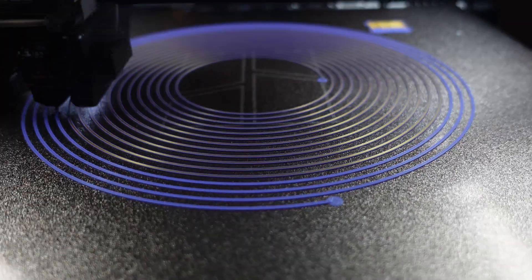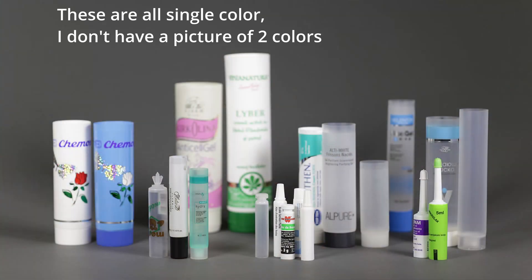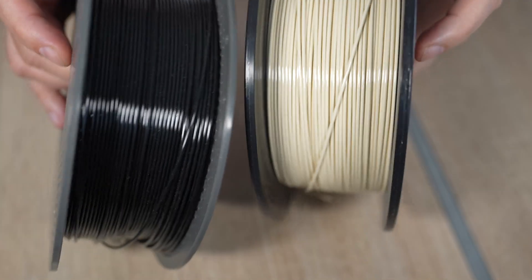This file used in this video I will upload to Printables, along with the source Fusion files if somebody wants to modify it. Maybe the layer adhesion difference between tough and silk PLA was too extreme, but even this confirmed the core filament layer adhesion theory. Now manufacturers have this tool to test their formula before mass production. Yes, the co-extrusion equipment is expensive, but once they have the tool and the formula, production of the filament is not expensive — and I know what I'm talking about because I worked in injection molding industry and we had extruders making these tubes with a two-color tool. I can see so many possibilities here: TPU inside and something outside to make the filament tougher, or elastomer inside with polycarbonate outside, giving decent layer adhesion while still being strong in X and Y direction.